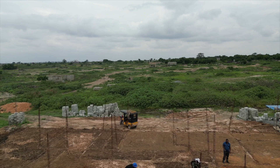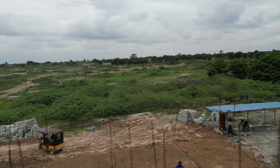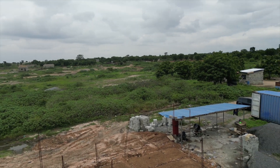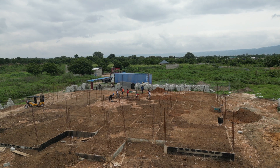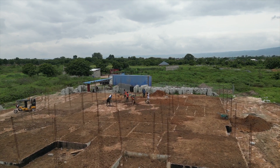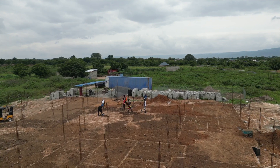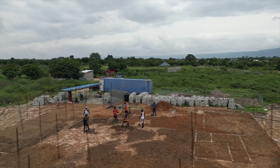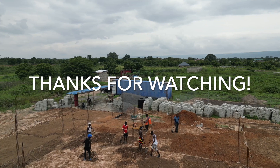Once they get there, we level everything out. All the soil on the foundation is going to be leveled out — you'll see guys standing around with pickaxes, digging up areas that are sitting higher, and using shovels to level it all out and make it nice and even. Then the compactor comes after that and pushes the soil much deeper into the ground to make sure everything is nice and even. It's not going to come out 100% leveled unless you put in all that work to make it as level as you can. Thank you all for joining me this time. I'll see you next week.